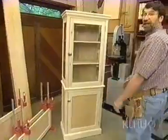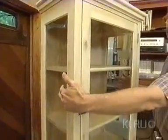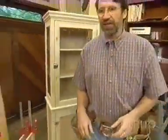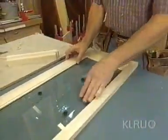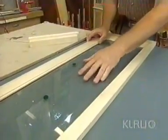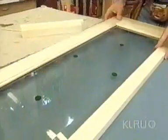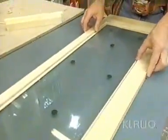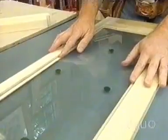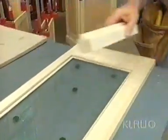Let's take another look at our prototype. The upper cabinet has a glass panel on each side and a glass panel door. Over here is one of the side panels, just dry-fitted together. You can see the beveled glass — the bevel faces out. This stuff is expensive, but it's worth it. If I flip it over, you can see that the glass sits in a rabbet. If I had set this in a groove and I broke the glass, it would be very difficult to repair.